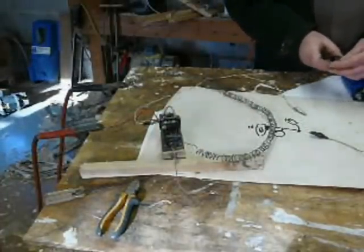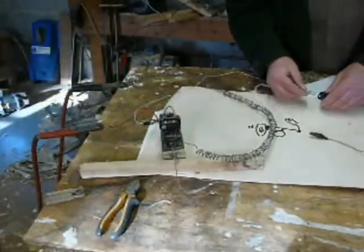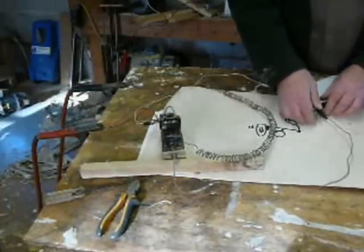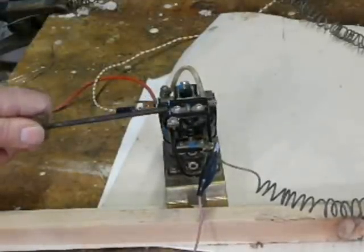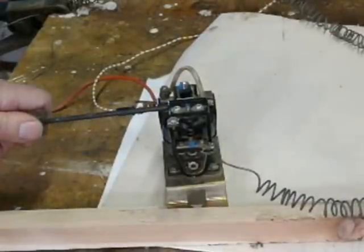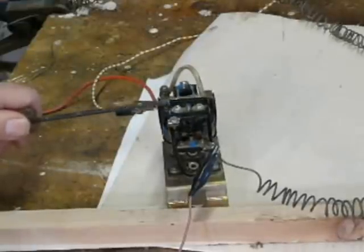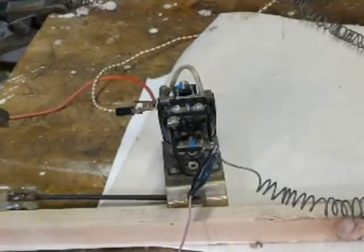What have we got here — got a dinky little one here. It's 680 microfarads at 200 volts. Let's see if we can try that. The negative goes to the negative. That's charged up. Try that. And there it is — you notice that sparked just to make good contact. Take it off, put it back on, and it will spark just for a moment. There's a little spark there. So you want more than 680 microfarads. And the 2500 microfarads does it absolutely perfectly.